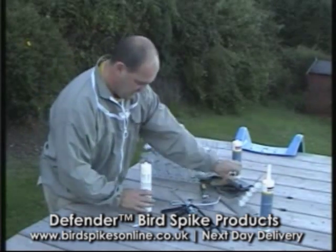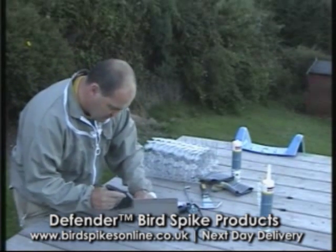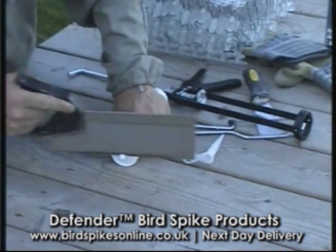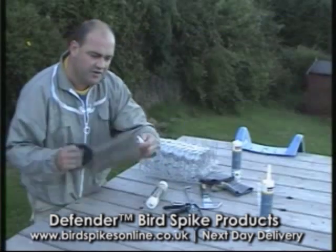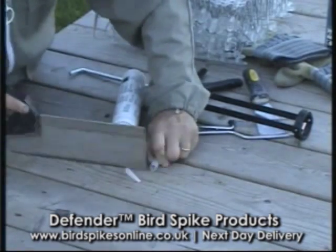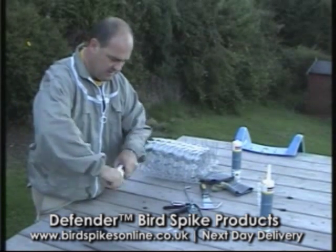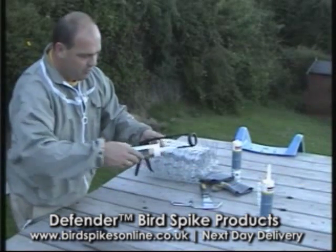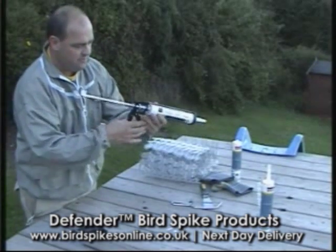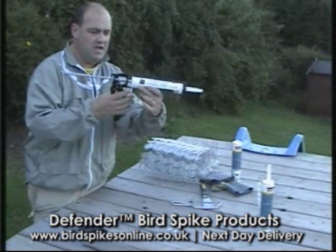First thing to do is I'm just going to cut the tip off there. And that then just screws on there. And that's now ready to go back in the caulking gun. I put the snout in first, push that in. Now that then clips in there. Now there's the trigger. I can just pull the trigger and that will go in. That's now ready to use.